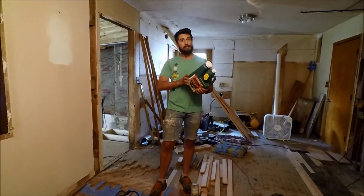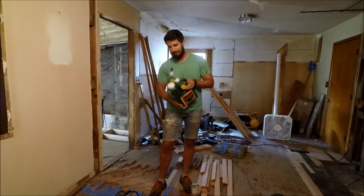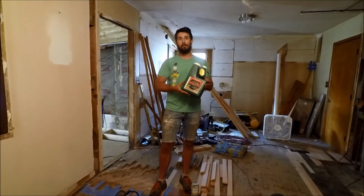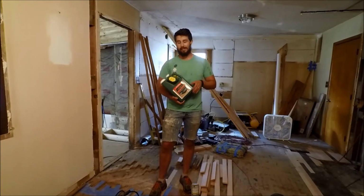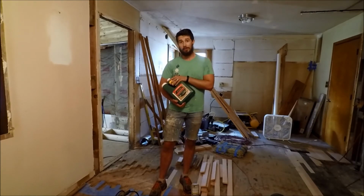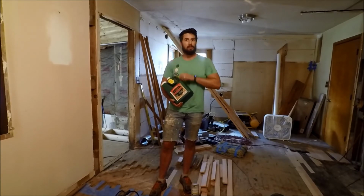So what we're going to do is actually only make 1/2 of a gallon of diluted amount. But we're not going to take this entire thing and pour it into 1/2 gallon of water. No, because it's actually meant to be mixed in with 4 gallons of water, because it's a 1:5 ratio when you get it all said and done. So we're going to make a 1/2 gallon diluted version of this at that same ratio, and then catch back up in the room where we're going to be putting it in.